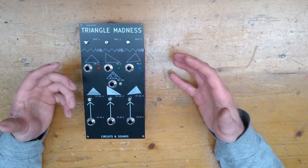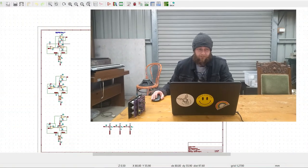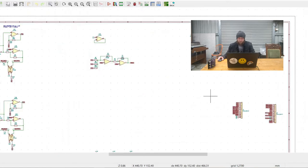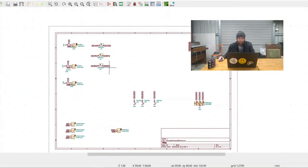So how is this actually designed with everything so perfectly aligned? Well, let's open up a few files on KiCad and take a look. The first thing I do is draw out the entire schematic into one file, then split off any IOs into a separate file, and use labels connected to the header pins and sockets to interconnect the two circuits together. We can see this in the main PCB schematic, where we have labels of the IO components which are then connected over to the headers. Then over in the IO schematic, we can see the exact same header connections as well as all the IO components.